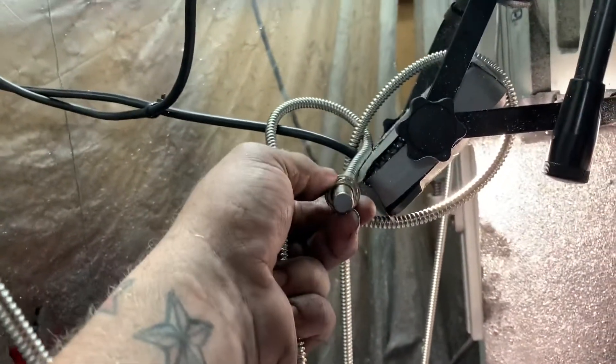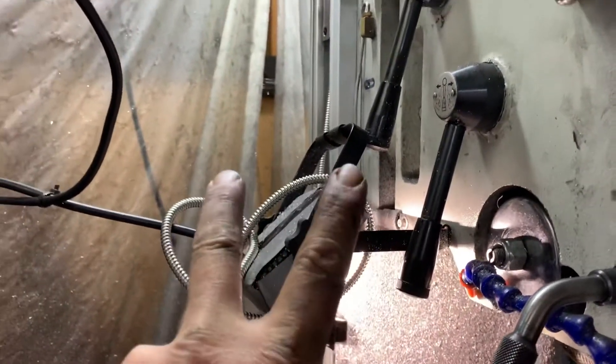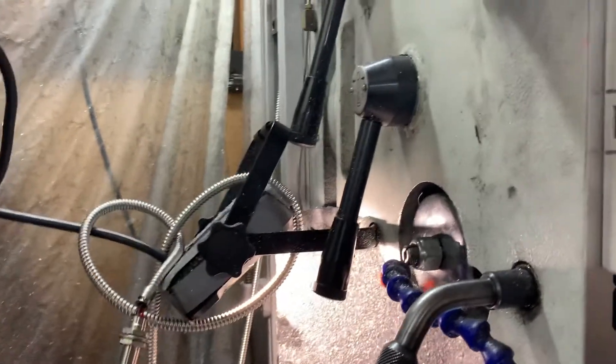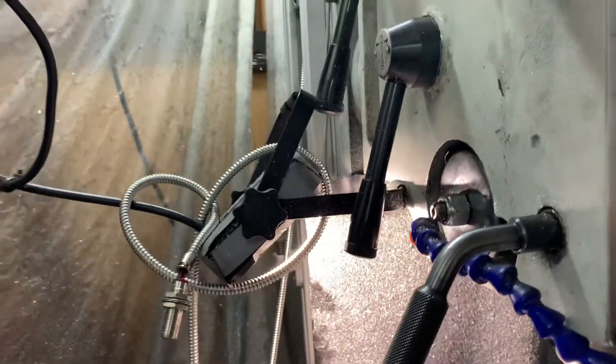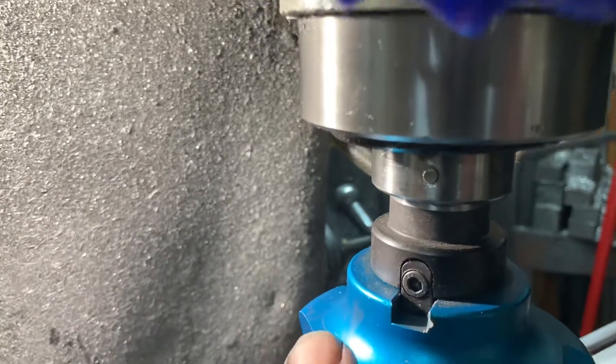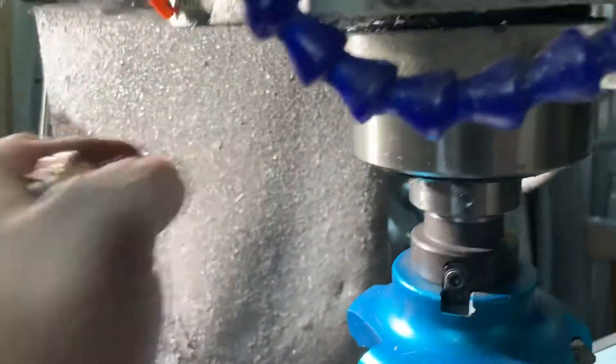But I wanted more features, including RPM, so I got the D80 and it works pretty cool. It's even got gearbox offset settings — at least two offsets — and I mostly run one-to-one anyway. For the RPM sensor, I just drilled a small hole and super-glued the magnet in there, and the sensor will have a bracket hanging out the back, all tidied up.